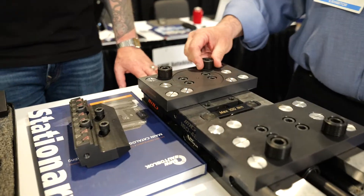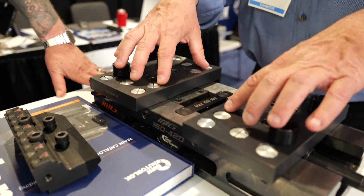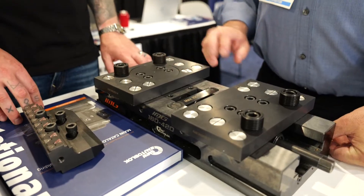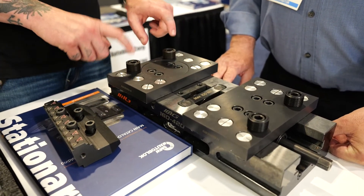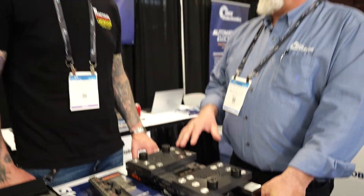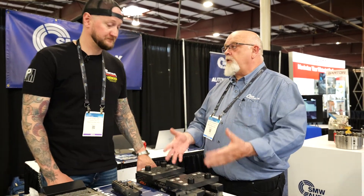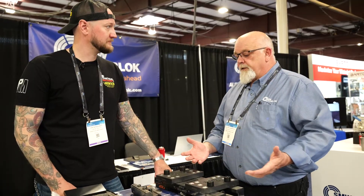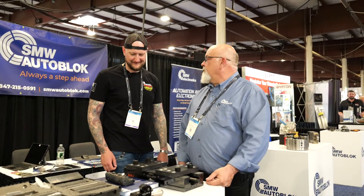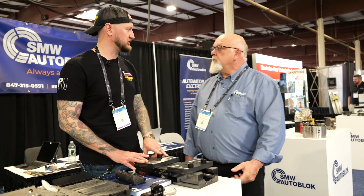We have serrated or smooth inserts that raise and lower the part however you want to use it. Each one of these locations gives you a different location for a different diameter. You can pop these off and pop them into any of these locations. What kind of industries are you seeing really utilize this a lot? Anybody that has a five-axis machine that's tired of changing out the work holding because they just have the vise bolted to the table. This does a flame-cut part, a water-jet cut part, an odd-shaped part — all kinds of different stuff. You can even make your own grippers for it, and you could run multiples on here if you have a really wonky-shaped part.